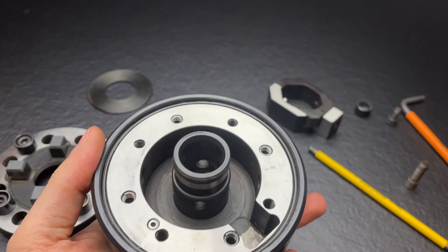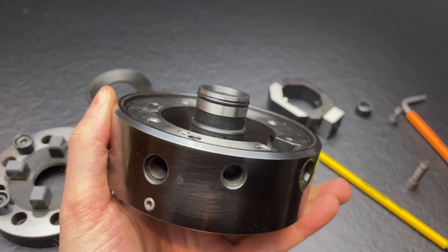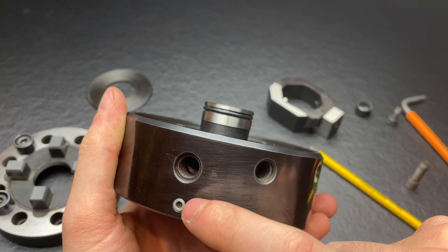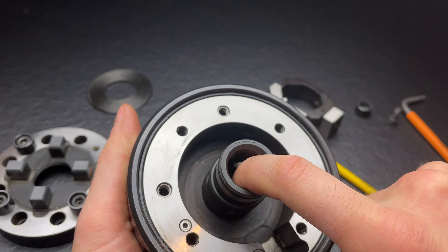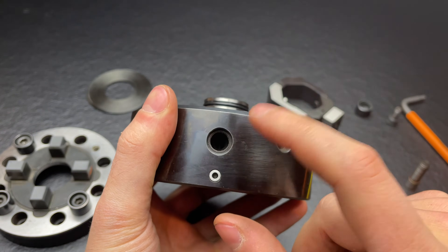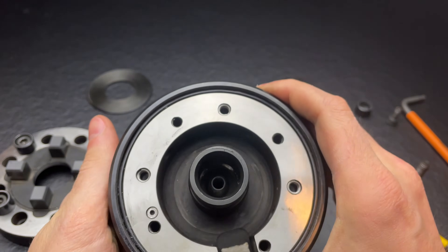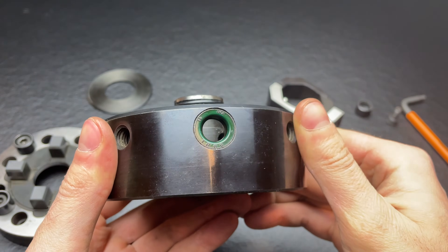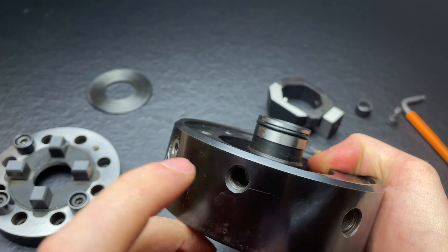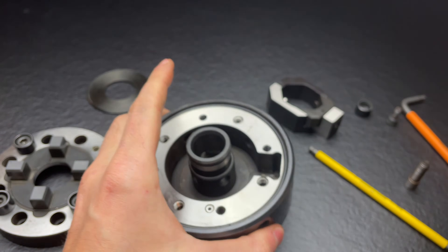Quite interesting — in the middle there is a through coolant hole. At the side there is a hole with a thread, and they drilled a hole right through the base inside, with a hole from the top. So if you blow air or coolant in, it flows through these two holes and comes out in the middle. I think that's a feature used for EDM work, not so much for milling. There are also these other holes — the first six millimeters is threaded, then there is just a plain hole, and I'm not sure what they are used for.